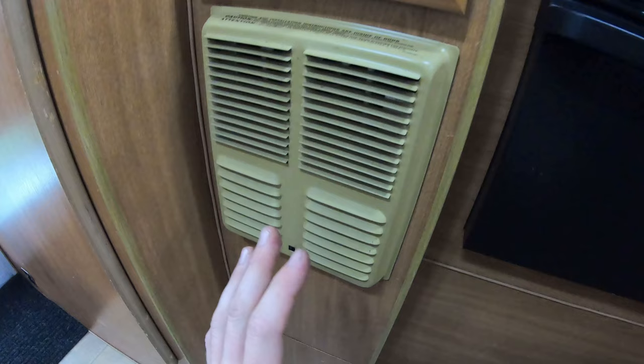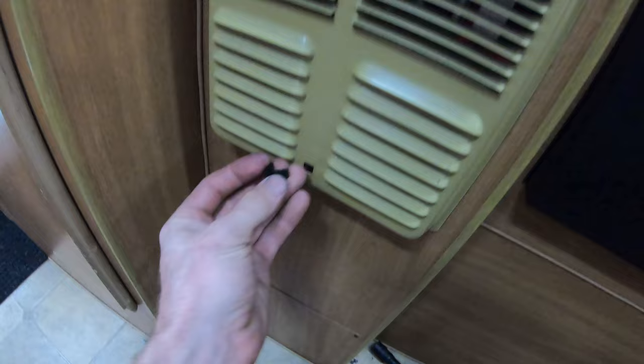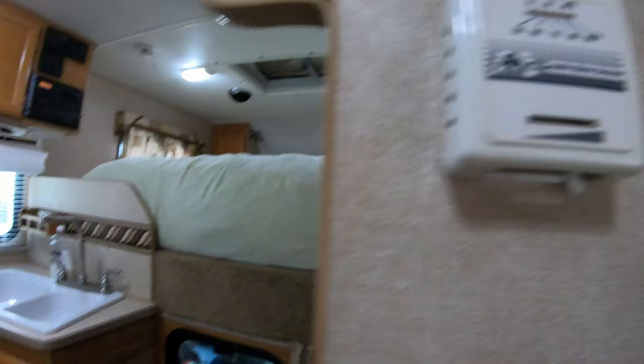It's now trying for the third time, and after this third time it doesn't light, it's going to detect that and trip — you'll see a red light start blinking in there. To pop the cover off, you've got this little plastic connector — twist that. Mine actually broke because of old dry-rotted plastic. With that off, just pull this out and lift up — simple enough. You can see that red light blinking back there. Here's your reset.